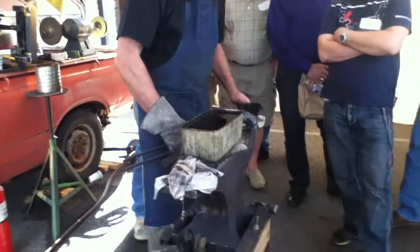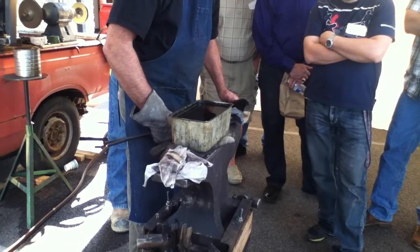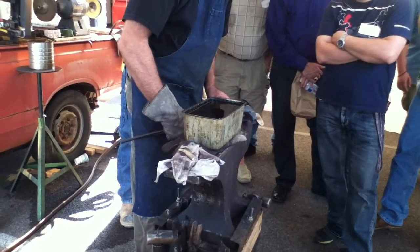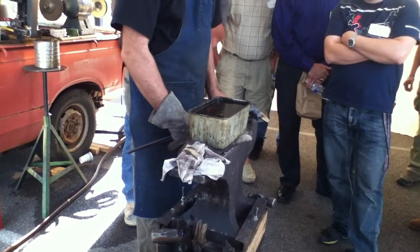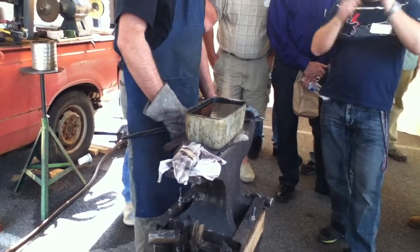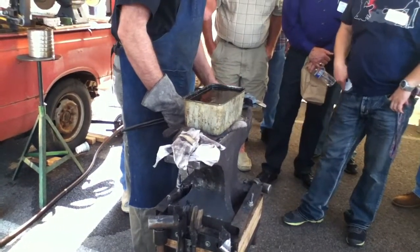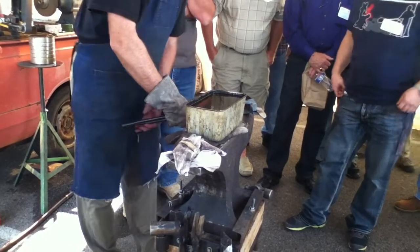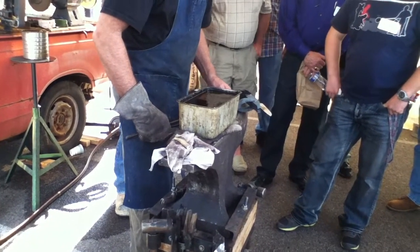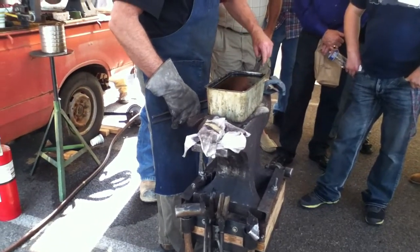The spine, I want to be in the blue to purple range. I just didn't want that one spot to get softer than the rest of the blade, so I stopped it. Now, if you want a really localized heat you can come up and work off of just the tip. These tongs are just getting to the right point for this thickness of knife. I had someone call me this week and say, can you show the hot tongs method?